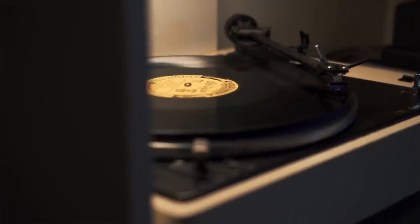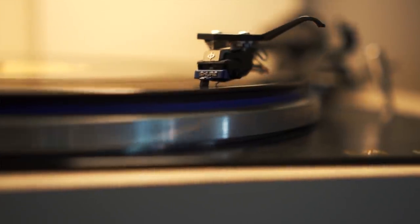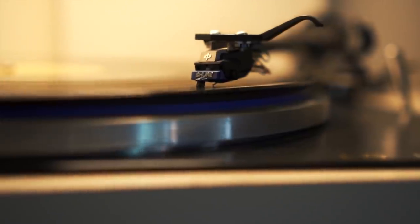If you're playing a piece of vinyl, and it's slightly warped, you will see these cones moving. And when that's happening, the amplifier has to deliver a lot of power. And we will see that when we were using the 6.8 watts, it was at those moments when that cone was moving, but audibly, we didn't really hear any difference.